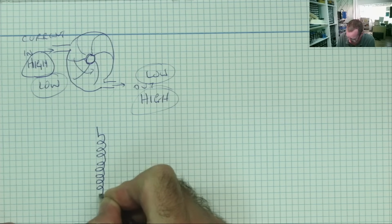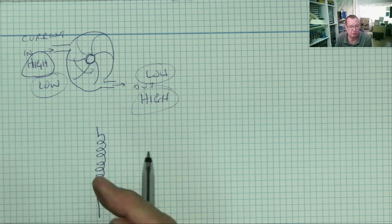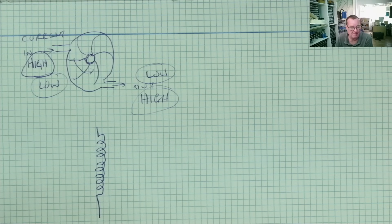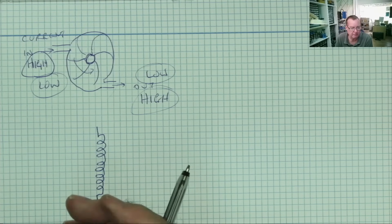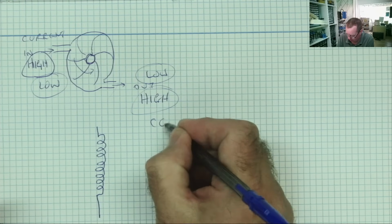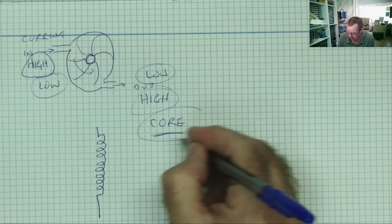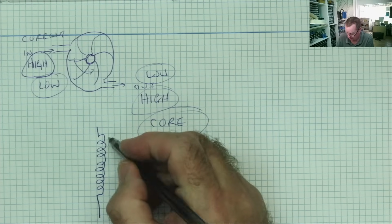and just to reply to comments from a few people on the first video, the former that I called it, which the coil is wrapped around, either metal plates or ferrite, it's a magnetic powder mixed with ceramic. I called it a former, but it should actually be called the core. Okay, so it's a ferrite core, that's the correct term. Sometimes you'll use the word bobbin, which effectively means the winding. I think it's a bit semantic and it doesn't really matter. I think we all know what we mean anyway. But the core is the thing that it's wound around, okay?